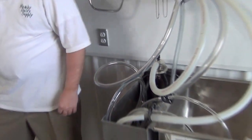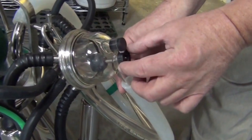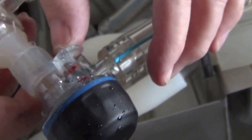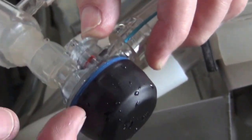For the cow milker, which is the same milker used on our 1501 milker, there's a shutoff right here and you want to lock this open — push it all the way in, that would be that position, but you push it down and turn it and it locks open, so that allows it to wash. On the sheep milker, which is an ITP205, there is a milk wash valve right here — we're going to push the lever down, which holds the valve inside open so that it can pull the wash solution through. On both units, we're going to push it down, down as if it were hanging on the udder, and that allows it to draw water.